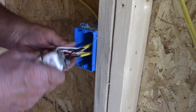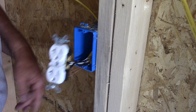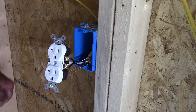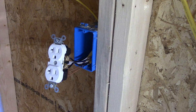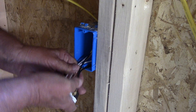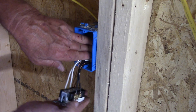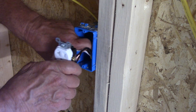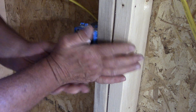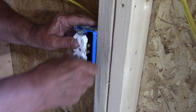Now it's time to put this back inside the box. As you can tell, the wires are sticking out a pretty good distance, so it's a little hard to push up in there. This is a little trick I learned years ago from an electrician — take your outlet, bend it downward like that, then as you bend it back up, take your fingers and go in there, push down on the main wires and just push it back up in the hole.